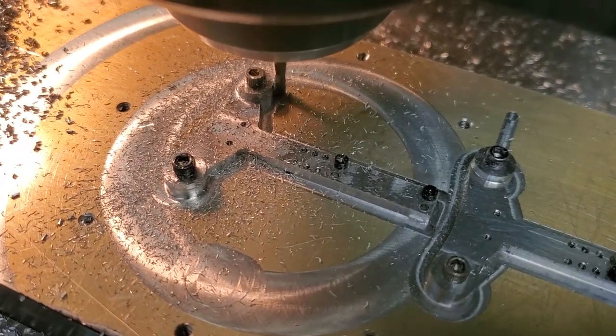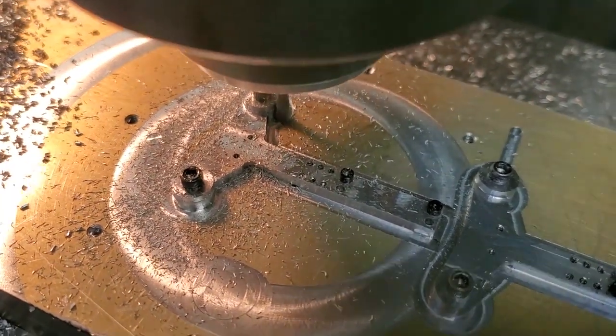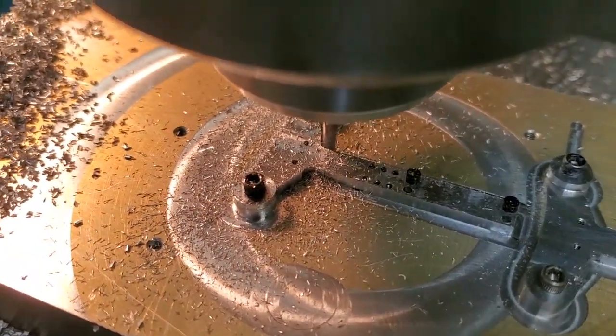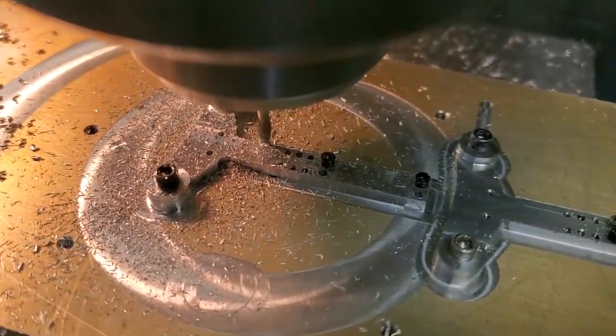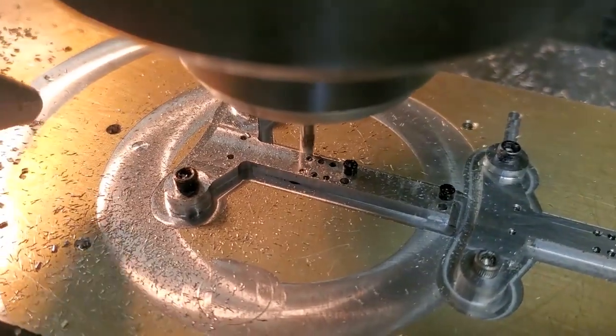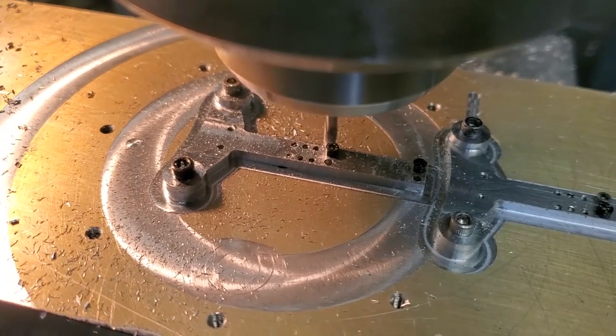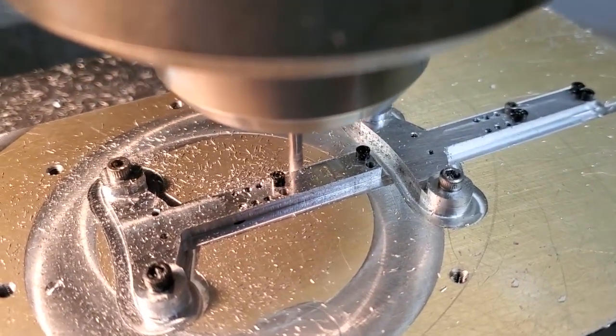I only wrote one path around — that's all I really needed, because once the first one's finished, I'll lift it and move to the position of the second one, which happens to be 2.2 inches away. Re-zero the milling machine and finish the other part.